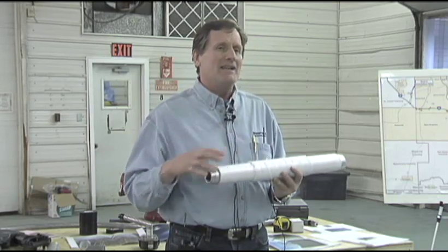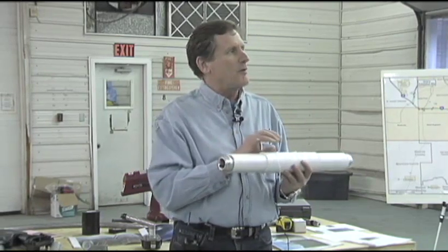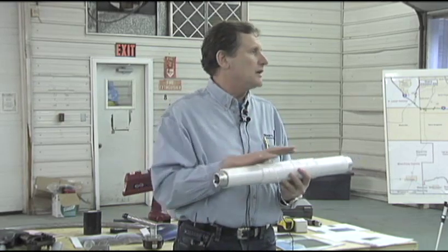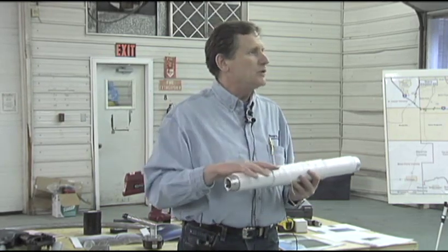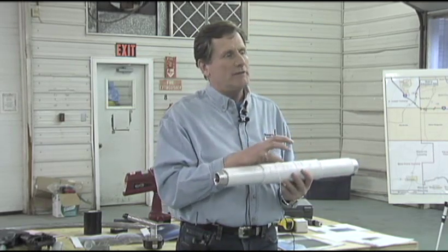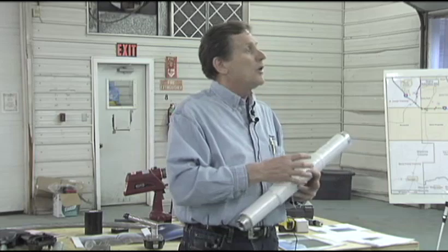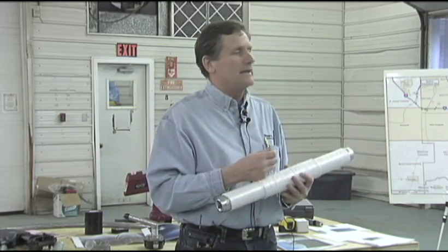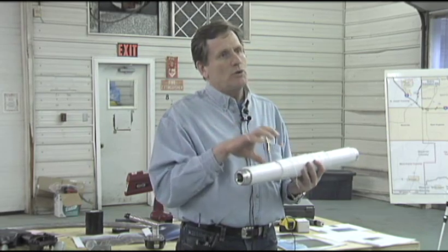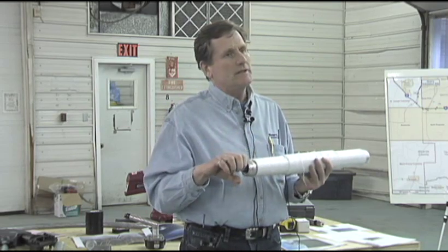Basically what it is, is a small amount of explosive wrapped around this aluminum sleeve. The explosive comes in the form of cord to make this uniform distribution. The amount of explosive is minute — maybe 120 grams — but it is well distributed over the sleeve. When this energetic material goes off, the energy generated, which you're very accustomed to having break rocks or mines, is now pointed towards the center of the sleeve and used to compress and squeeze this tube along the conductor.